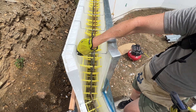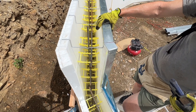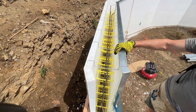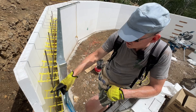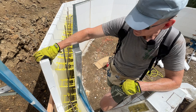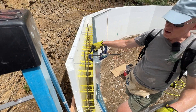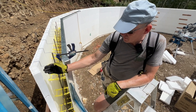The metal wire chair rail goes below the surface so the steel caps can go right over the top of it easily. There's still going to be one more rebar lane on top of that little chair rail. The rebar sits down in there. So the extra steps on this final level are the caps and the chair rail, and then when you're putting the concrete in we need something to hold the concrete back.